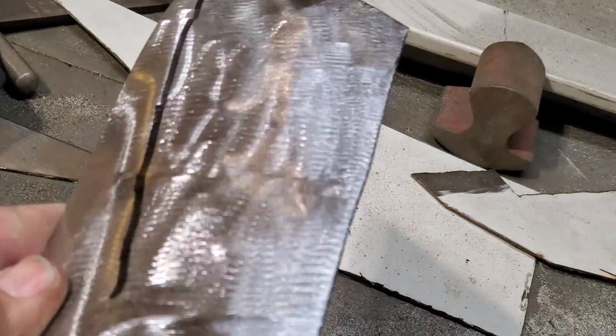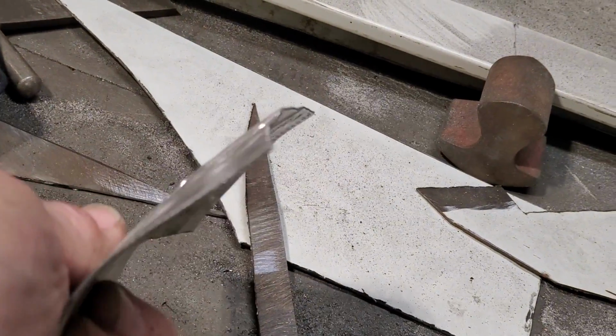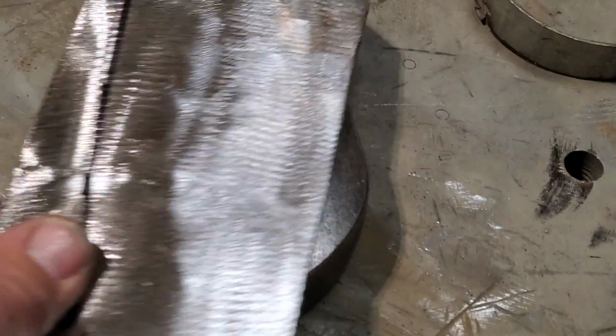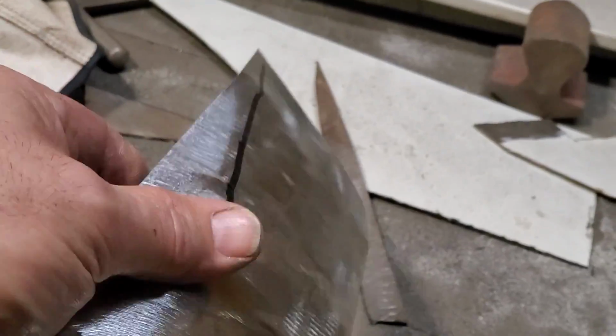This is all it looks like, okay? When you hammer it, it looks rough. A little dents in it. But you can see that it's got a curvature gone into it now. Okay, as rough as that is. I'll turn around now and I'll play with that. I'll hammer that onto the curved section of the dolly here, flatten it out, then I'll go over the English wheel and run it through that and get some shape to it.